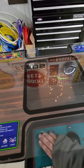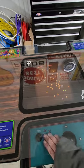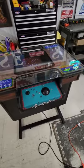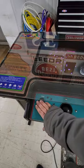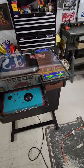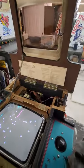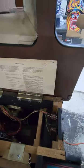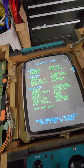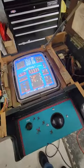You can see it's identical to the way it should be because it is running on original Atari hardware. It has the original monitor, original power supply, original everything — other than just that one little kit with some additional ROMs. It's even running with the original processor; the kit has you use the original processor that came with the game. Inside it's nice and clean. It's still got the Millipede dip switch settings, although with this board you actually have on-screen settings for all the options. It lets you just step through all the different settings — really well done. Whoever made this kit was quite brilliant.